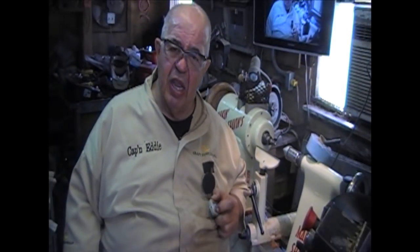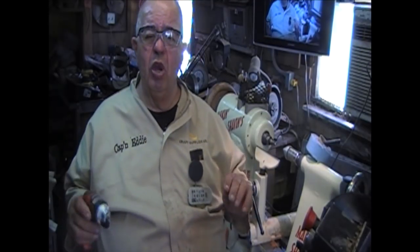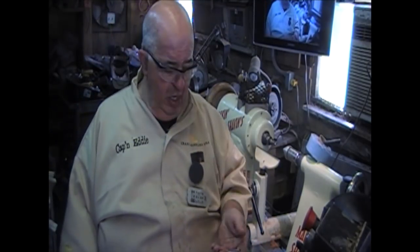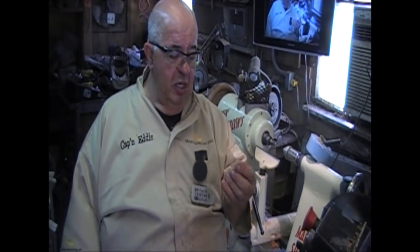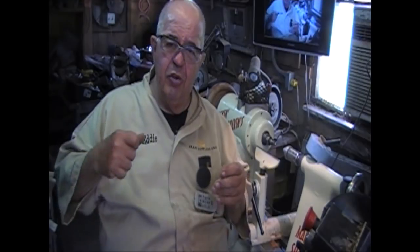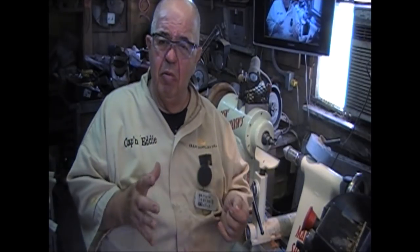But these are available at my local lumber yard, where they install fasteners for hanging cabinets and millwork and all that. Because you don't want to put cabinets and millwork up with drywall screws. I'm on a rant here, okay? They break, and you don't know when they break, but you'll make the front page of the paper when it happens. So, get out your screw gun, get your square drive. These are number 12s. And drive them in that pre-drill if you have to, because you don't want to blow up the block.